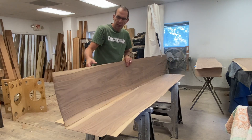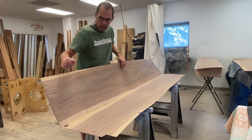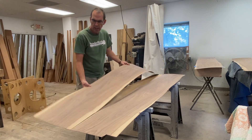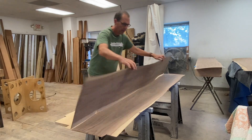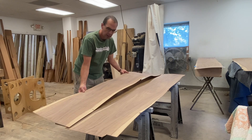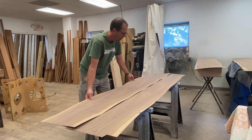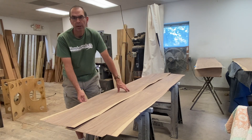These just have a little bit too much sapwood and the edges kind of sanded through a little bit here. So I am going to splice two pieces kind of like this — it came out as a book match. I'll open them up and then lay them out to the point where I can get rid of the sapwood and splice the two pieces together.